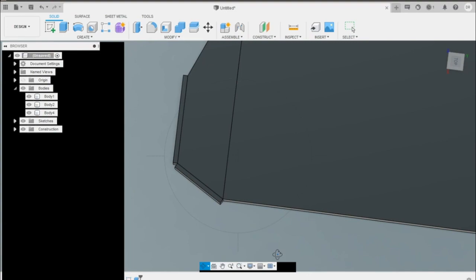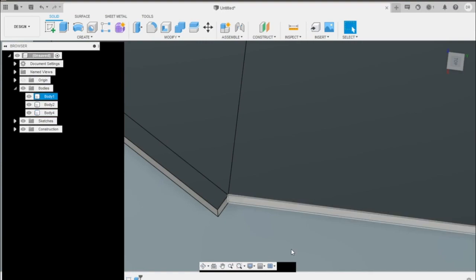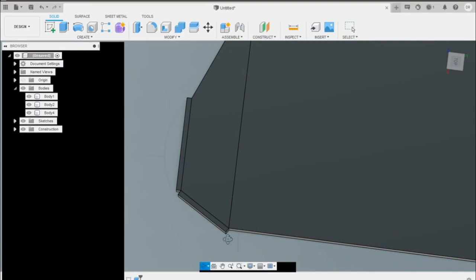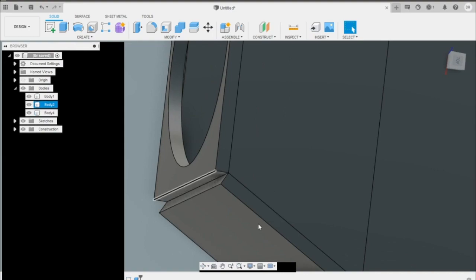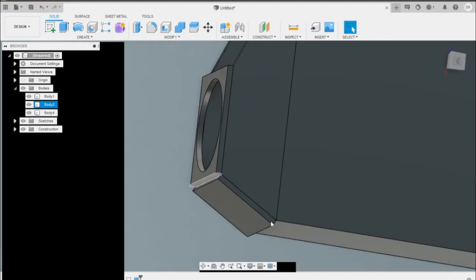So we can do one of two things. You could bring this inwards, but that would leave you with a big gap here. So what I like to do personally is just grind this plate flatter here. Once you're constructing the tanks, I grind it here to make it a little bit flat, and then I go ahead and make the weld. And then here, you can see there's a nice V to push the weld nice and deep and penetrate it really good right there.